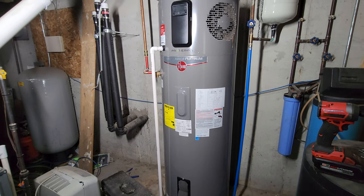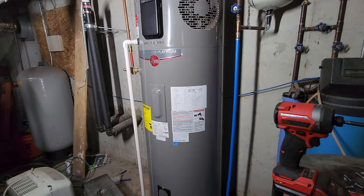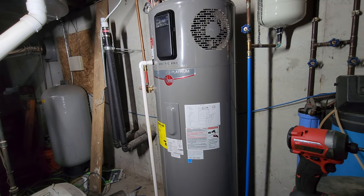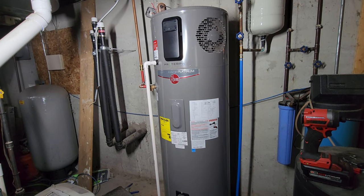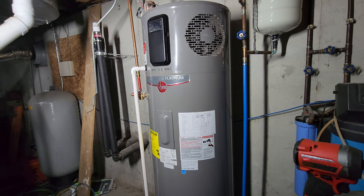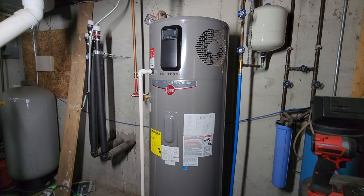I'm not going to get into the money aspect yet - it is cheaper to heat water, but whether it actually saves you money long-term depends on how long the compressor system lasts. We also have a heat pump dryer, which uses very similar technology. Essentially the compressor on top extracts heat from the surrounding air and blows out cold air. Heat pumps transfer warmer air from the surroundings into the tank - same principle as an air conditioner, which doesn't actually cool the air, it merely transfers heat from one place to another.